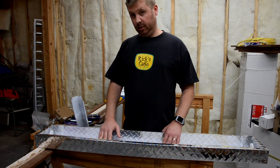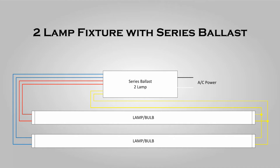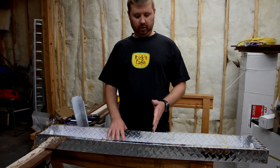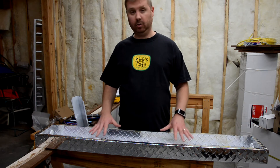How do you know which one you have? Let me show you a diagram. This here is a parallel ballast — most fixtures will follow the same wiring color, so this should look similar to what you see in your fixture. This one is a series ballast. Now if you're replacing a parallel with a parallel or a series with a series, it's very easy — you can just match up the wire colors and that's how you wire it.